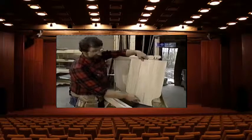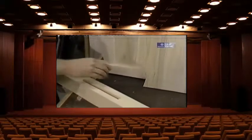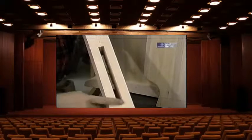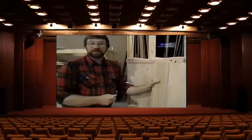Now, my side pieces need a tenon at the bottom and at the top to fit into the armrest and into the foot. The thickness of the tenon is determined by the mortises that we've already made. I want them to fit in there snugly. And I'll cut the thickness using my radial arm saw and the dado head cutter.